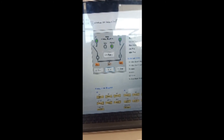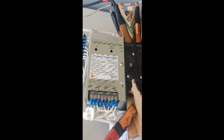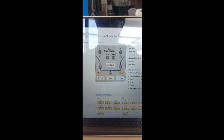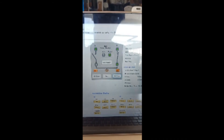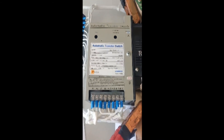Back on the laptop, open it — in milliseconds you can see the change-over and it will open. Back to the ATS, now off. Then close to QS2. The contact now connects to QS2, and the ATS is now loaded on emergency.